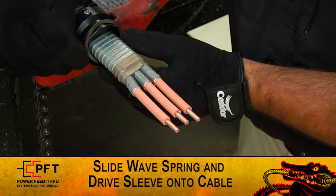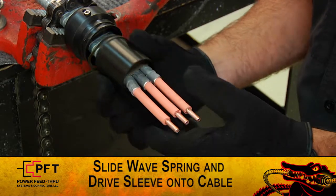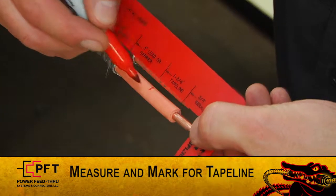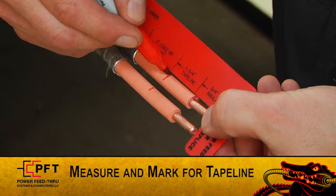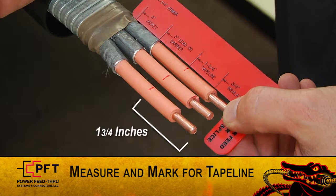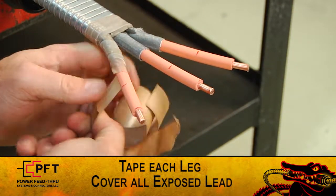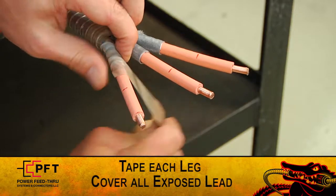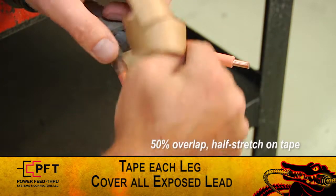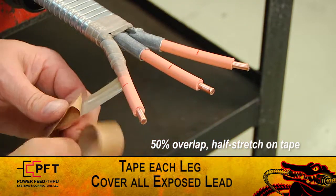Now slide the wave spring onto the cable and up to the armor adapter. Then slide the drive sleeve up to the wave spring. Use the supplied red cut gauge and measure back 1 3/4 inches or 44 millimeters from the end of each conductor and mark. Using the supplied high modulus tape, begin taping each leg. Start at the armor cut using a 50% overlap and a half stretch on the tape, and wrap to the 1 3/4 inch tape line mark.